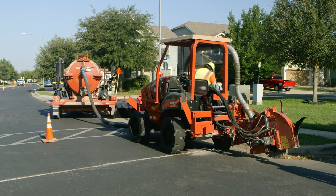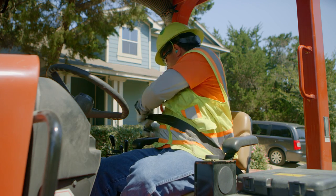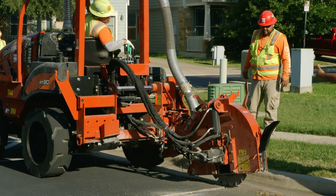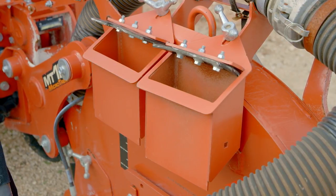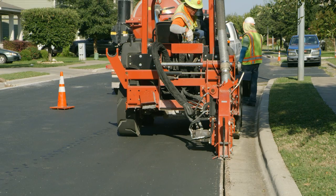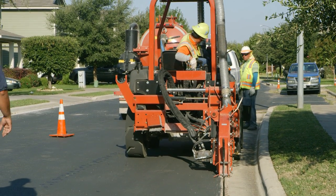Secure the microtrenching path for the planned trenching section. Line the microtrencher up with the proposed path. Wear a seatbelt anytime you are on the trencher. Set parking brake and then lower the microtrencher to just above the ground. If needed, adjust blade and spoils deflector to appropriate trench depth. If chutes are used, set the spoils deflector as close to the blade as possible. Always operate with the blade cover and the chutes or chute plates in place, if equipped.